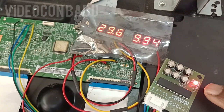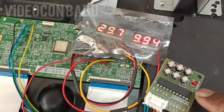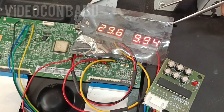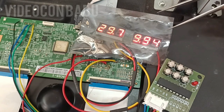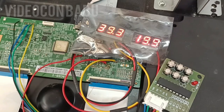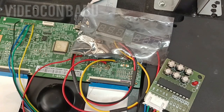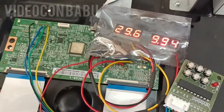4 times — save this function so the time is delayed. See the light blinking — the booting time will get delayed. 4 times blinking means 32 seconds delay time. If you don't want it, it gets reset. Now I am going to switch off this set and on — one time blinking means power on the board, no program.